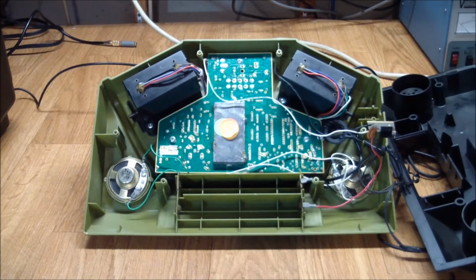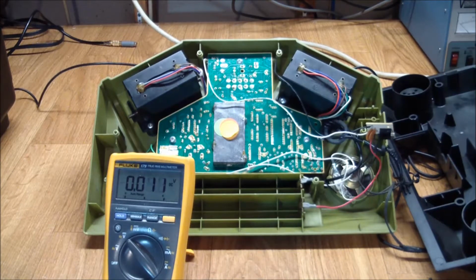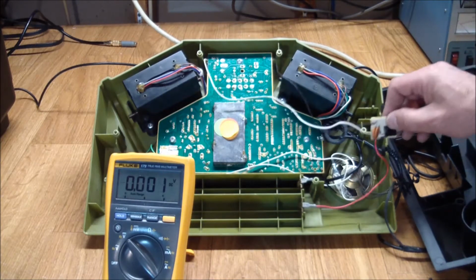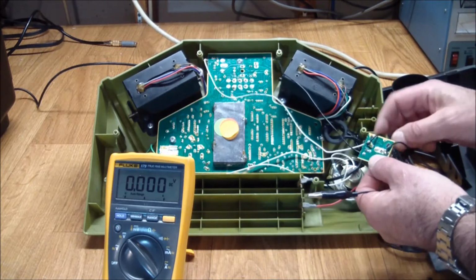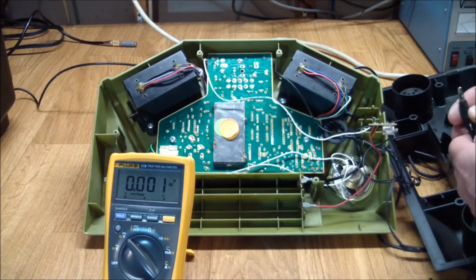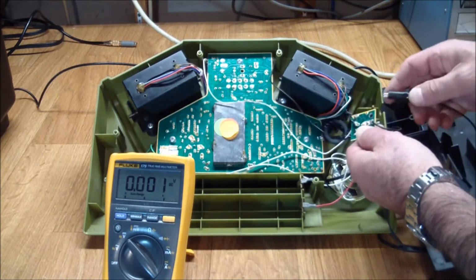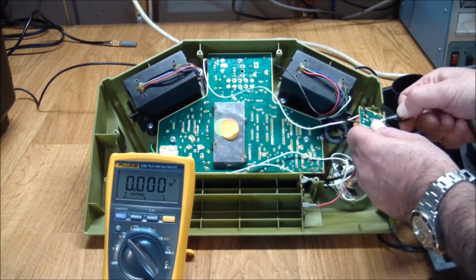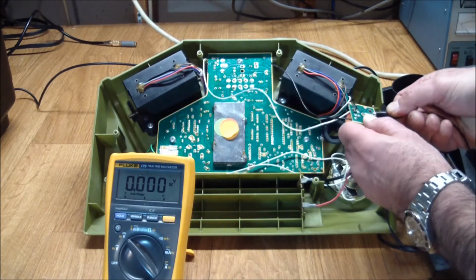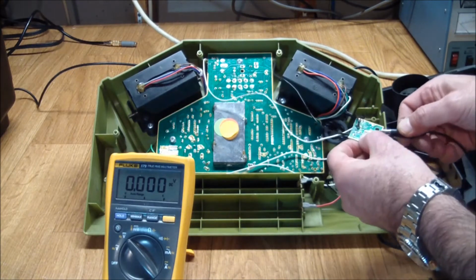is coming in. The unit is off. I've made sure of that. And first we need to connect ground. Now looking at this, this wire has a stripe on it, so I'm assuming that that's the positive side. If of course this thing is a DC, but it most likely is. So let's hook up the ground to this connection here. If I can get a good connection.